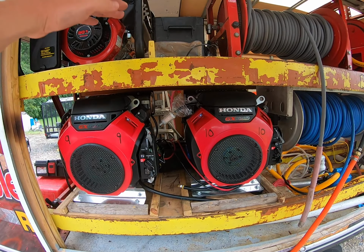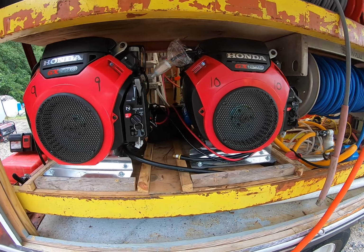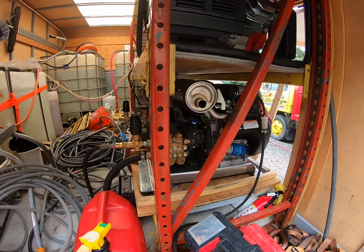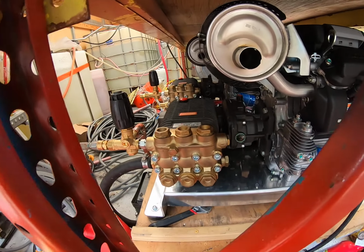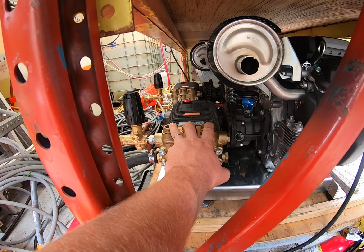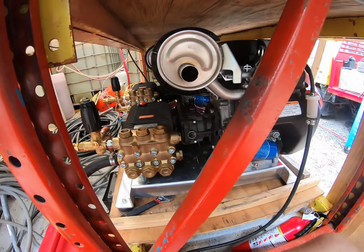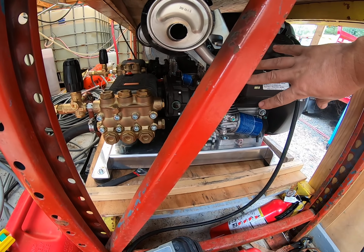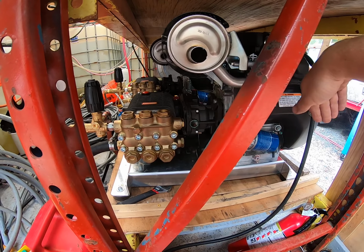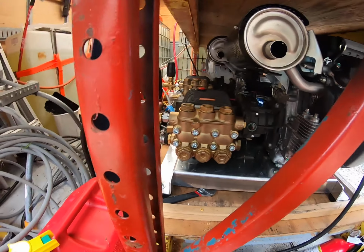We're going to end up moving this shelf up another rung soon. These are gear drive. We'll come around here and show you. So you can still use the same 8 gallon a minute 3500 psi pump with gear or belt. It really does not matter. On a belt system, this whole pressure washer would basically be rotated 90 degrees so that it's going this way with it, and then the pump, and I'll show you one of our belt drives in just a moment.